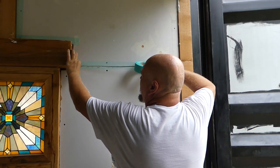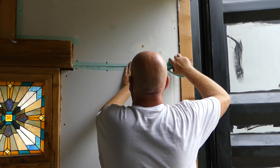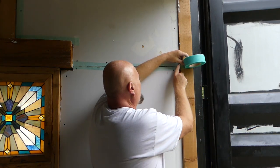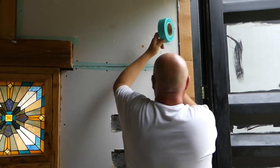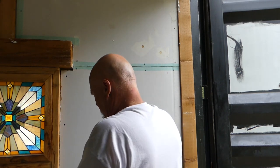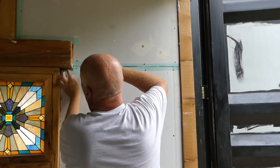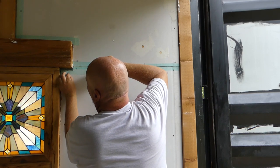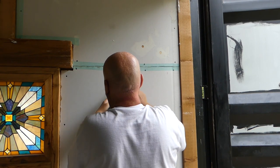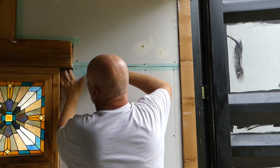So I try to overlap is what I'm trying to get to. So I'll do the shorter cross pieces and then I come in with the long piece and tie it together. Most of the time. This particular one, because I had used it as a demonstration, is partially done earlier. I did how to drywall to a live edge log, which I did over in that corner. So it's partially done here, and that's not a normal condition. Normally I tape everything, and really, realistically, if I was ambitious, I would have taped the whole container and then did it, but that's not how it worked out.